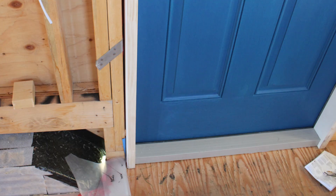The interior part of the threshold on the original jamb was a gray plastic material, but this new one had some pretty bare wood so we used some of the stain we've been using on our exterior siding to give it a bit of a protective coating. Then we went ahead and put caulking in the seam pretty much anywhere that the metal exterior portion of the threshold made contact with any wood.